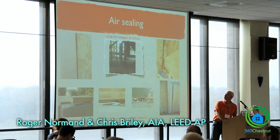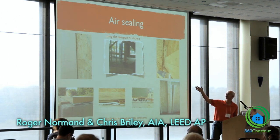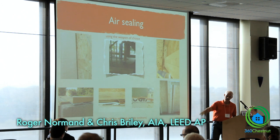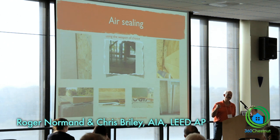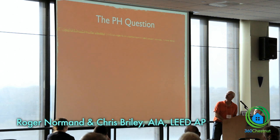And here's an example of if you're not thinking ahead, we have some of our walls that are 12 inches below the floor deck. And unless you foam the wood-to-wood connections before you stand the wall up, then you get a problem. So I'm hoping that a flexible plastic tube will be able to seal those wood-to-wood connections.